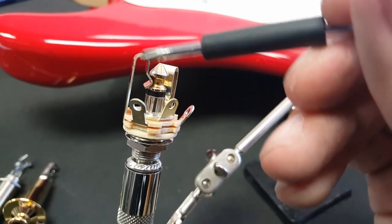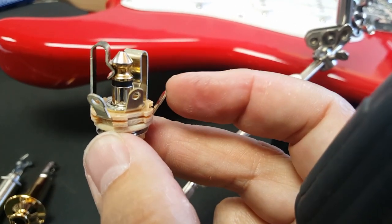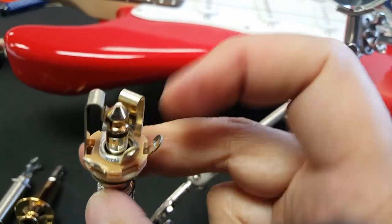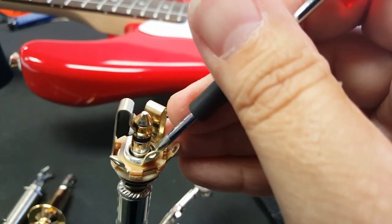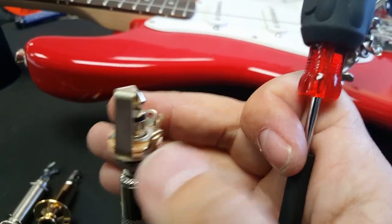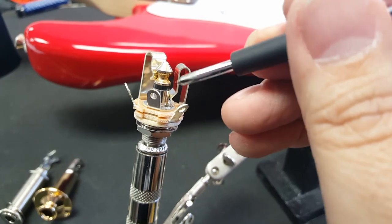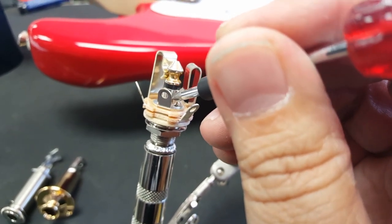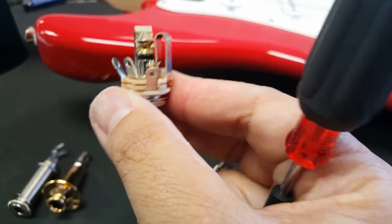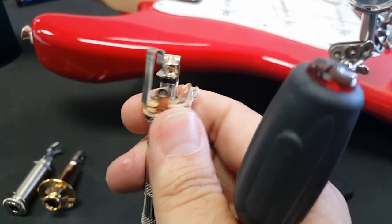This, of course, is the output, so the tip goes to this one. You would follow this piece right here — it's the bottom ring — so that is your hot. You would solder your wire right there. We already know from the other output jack that whatever touches the sleeve is the ground, so you would follow that wire — it's right there — and that's your ground. Now you have a third terminal for the 9-volt battery. Ironically, it's also touching the sleeve. So you would put your additional ground wire to that top terminal. You have two grounds and a hot — you'd only need that if you have a 9-volt battery.